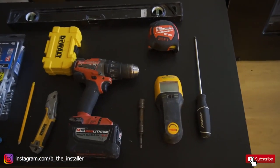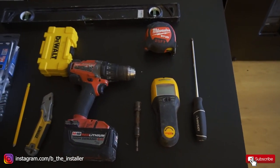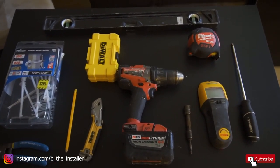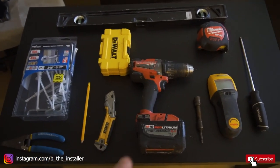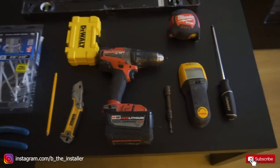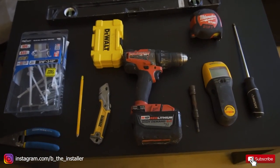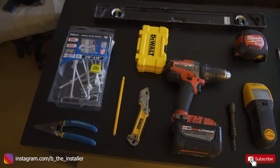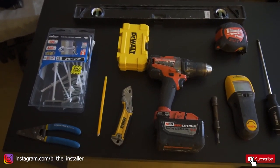Let's go over the tools you need for this job. First, you're going to need a screwdriver to put the bracket on the TV. You'll need a pencil and a tape measure to figure out where things are. You're going to need a stud finder — you can watch my video on stud finding if needed. Of course you need a drill and bits; this one takes a one-quarter-inch bit. You'll also need a socket and ratchet set with an adapter, possibly a knife, toggle bolts, and a level to make sure everything is good.